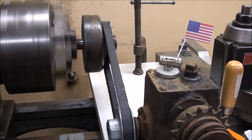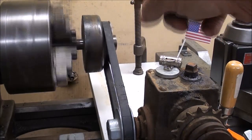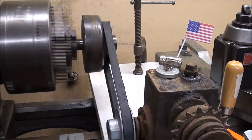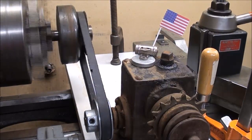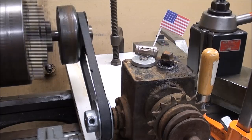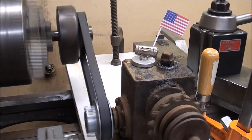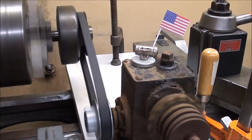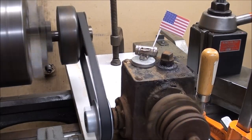With the machine turned on and the lathe clutch engaged — not to be confused with the centrifugal clutch — at this lower speed of only four or five hundred RPM, notice that it is not driving at all, simulating the idle. The lathe is now running at five hundred RPM. Up to a thousand RPM — still nothing happening. Approaching eighteen hundred RPM is when it started to engage. At two thousand RPM, it appears to be fully engaged.